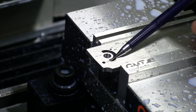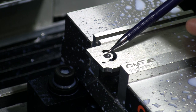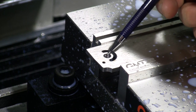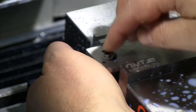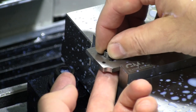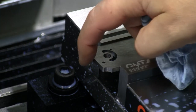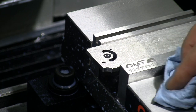For the most part it looks really good — the crescent we cut in there looks nice and the holes look good. However, the quarter-inch pivot hole had a rough finish because the end mill was a little bouncy and the reamer didn't clean it up. I think I'm better off boring that quarter-inch hole rather than reaming it. Everything else turned out pretty well, so let's get this out, cut the finger notches, and then move on to the handle slab.